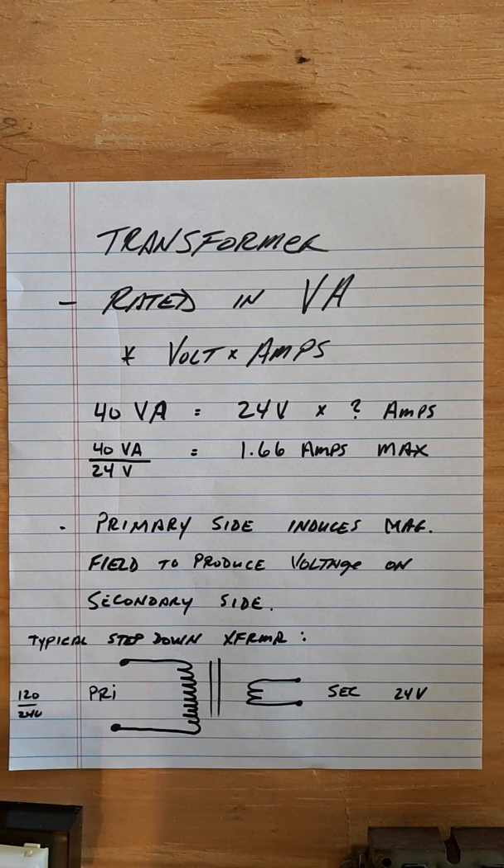On the primary side we have two transformer types: step-up and step-down. For example, an oil furnace is a 120-volt appliance, but you need roughly 12,000-plus volts to get the oil ignited properly. So in an oil furnace we use a step-up transformer — power comes in at 120 volts, goes into the transformer, and comes out at around 12,000 volts, stepping the voltage up from primary to secondary.